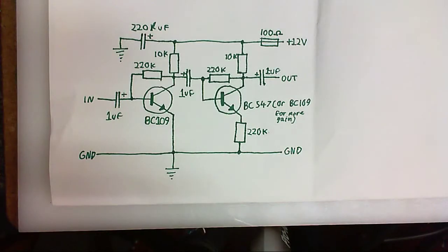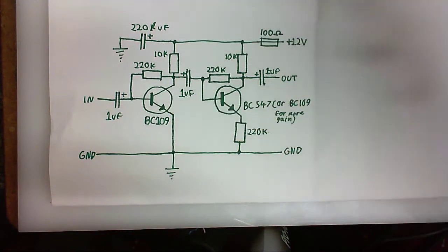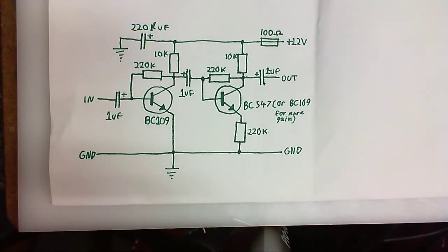Well, I think I'm going to wrap up now. The JFET stuff really did not work as good as I thought it would. You see, I was going to build a new microphone preamp, which is going to be the subject of the next video. Now, it's going to be based on this circuit here, except I was using a JFET there and obviously connecting it up the way a JFET would be connected, but it seemed to be incredibly hissy.